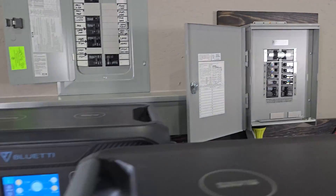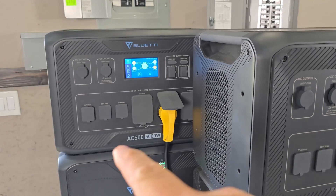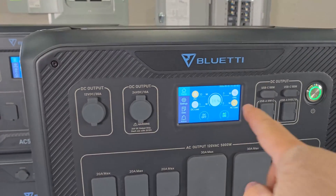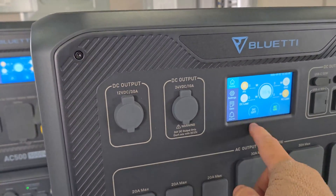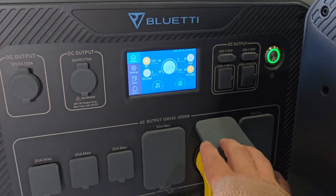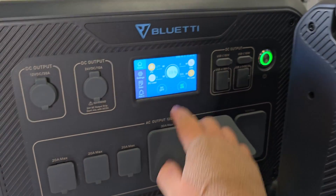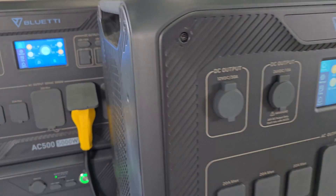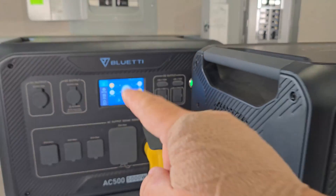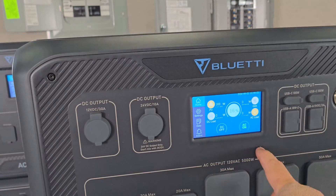If I come back around, you'll see we're using some power — 500 and some watts right there. Because I have it plugged into the front of that unit, this one's not showing it even though this is the master. I can't turn that off without turning this off. That's why I like putting loads into the slave — if I try to turn off the slave, it won't let me. The only way to turn it off is to come over to the master, which would turn off all my lights. So if you put a load into the slave, you can't turn off the AC outputs without going to the master to do that.